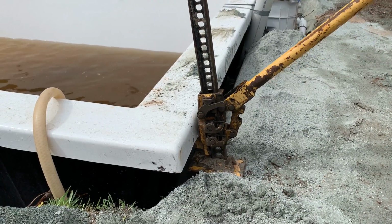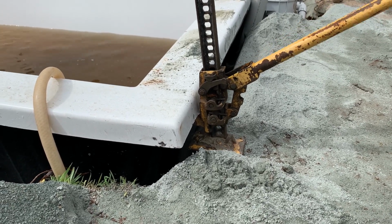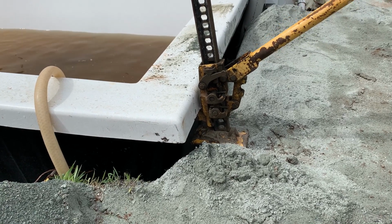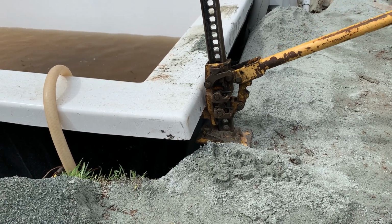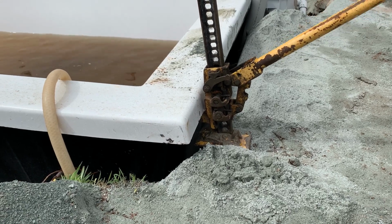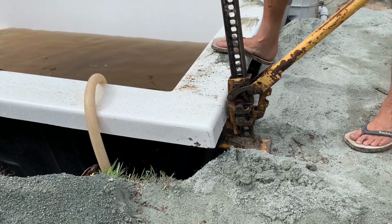We've skipped ahead about 3 or 4 minutes now, and that whole time that water rod's been there sitting, pumping water into that corner. So the installer's back rocking the pool, and what installers talk about is when you get enough water underneath that corner, it starts to lift the pool. And it's what installers will say, you feel it on the jack go a little bit light, and that's what's going to allow you to lift the pool when there's thousands of kilos of water sitting in the pool as it is now.